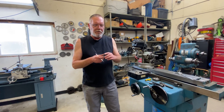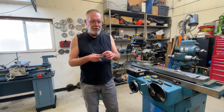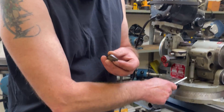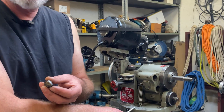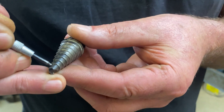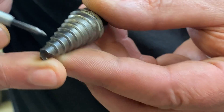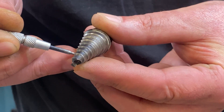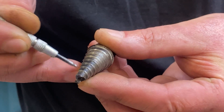We're not going to sharpen the face of this — we're going to leave it alone. We're going to sharpen the outside of it. We're going to use our two-way cam relieving fixture and create a cam relief on these surfaces. This will be a radial relief, and this will get an axial relief put onto it.